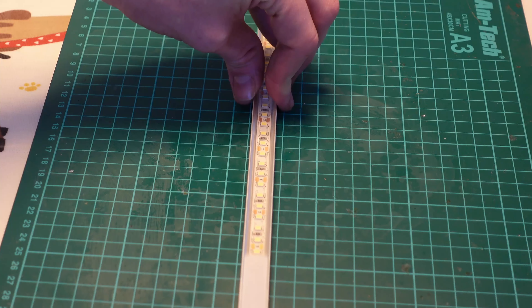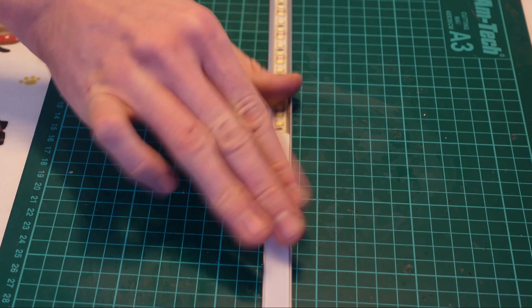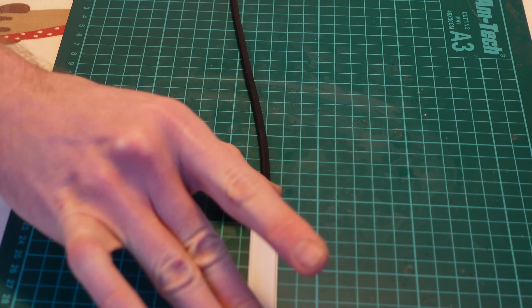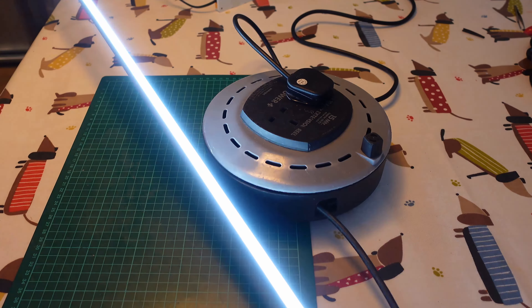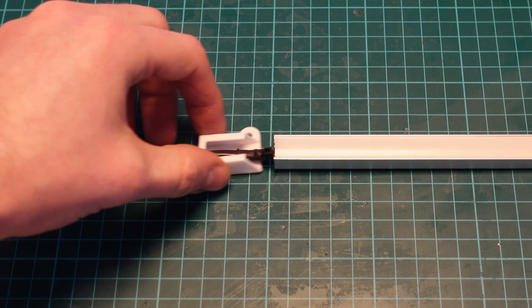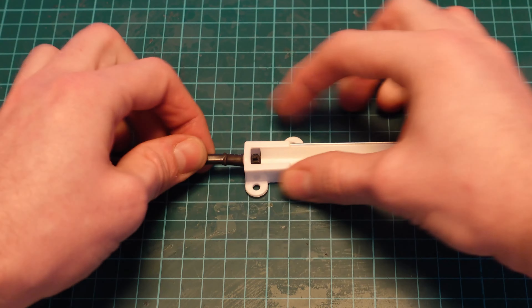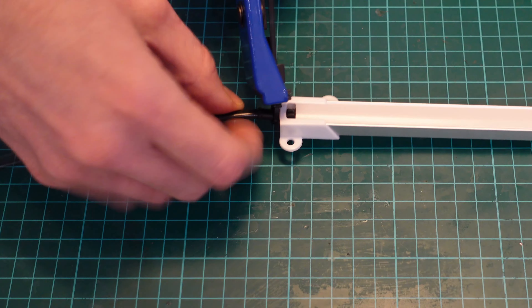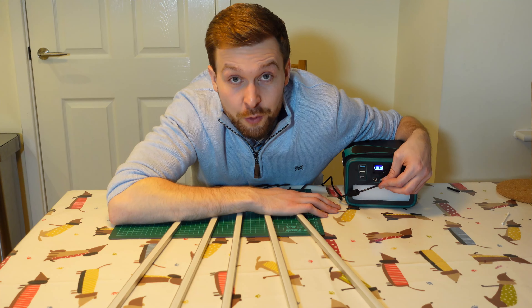Now that we're happy with that, let's sort out the harshness of the light — this is where the diffuser strip comes in. Mine just slides into a groove, but did take a bit of effort to get started. This one's just gliding along, though I did have some others which needed a bit of persuasion. Now with this in, it looks 10 times better. Let's finish it up by sliding in the end cap. I had to make the wire hole a little larger due to the heat shrink. If you don't have any pre-drilled holes, you'll have to make some. Wrap around the other cable tie, making sure it's tightly pressed up to the end cap. This gives us a much stronger joint than just the solder or a clip. And then you've just got to rinse and repeat those instructions for all of your batons.